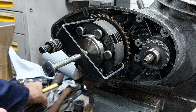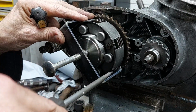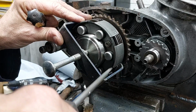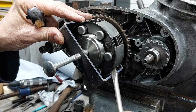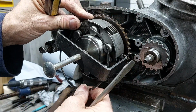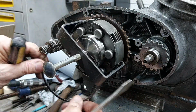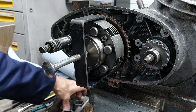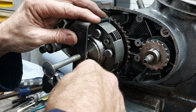I drilled the hole in the flat bar and tapped it as well, so that I could initially run the bolt through fairly square, and then I ran a nut down on the inside, made sure it wasn't done up too tight, and tack welded it in place.